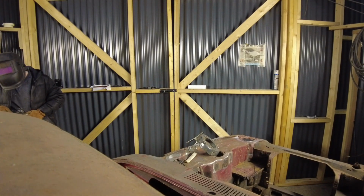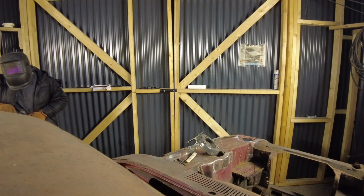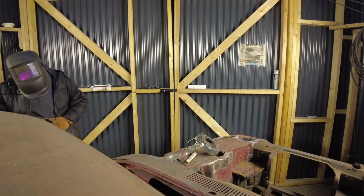Notice as well, you weld them with the copper behind. Yeah. You don't over fill the nozzle up. Like it spits a lot.